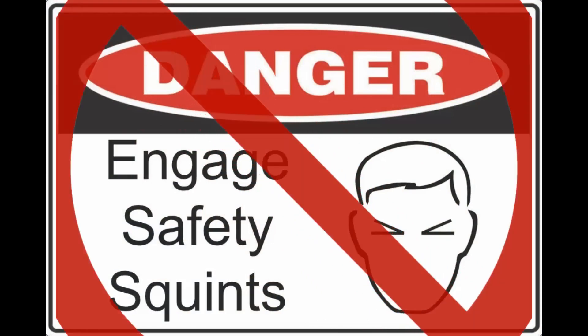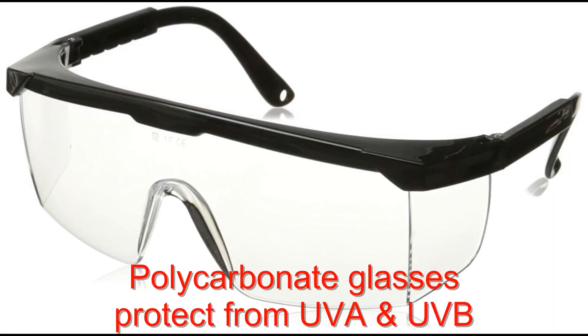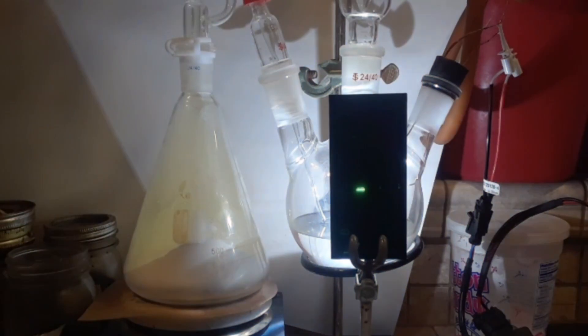Normal eye protection should protect your eyes from UVB, but UVA remains, and the arc is still bright enough to cause eye damage. You should rig some sort of shield to block your line of sight to the bulb. I'm using a number 10 welding shade here.